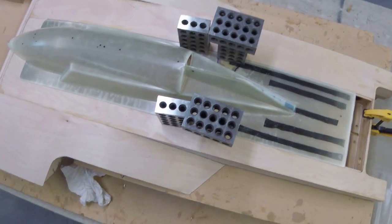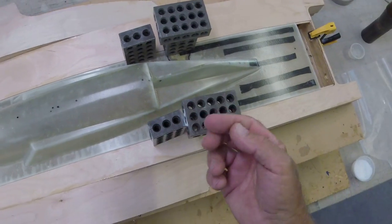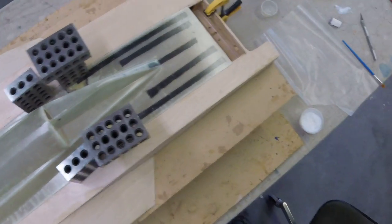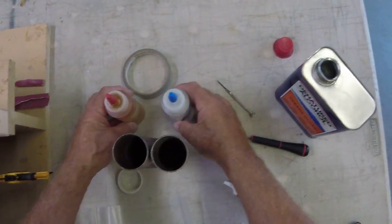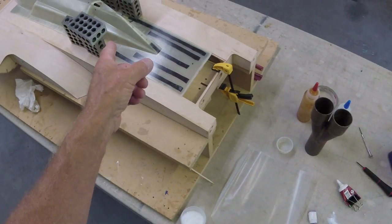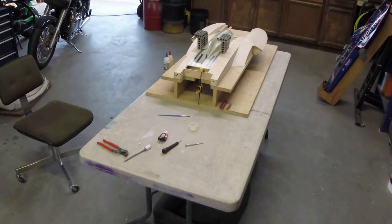Only time will tell. Worst case scenario, you can set a good soldering iron on the end of that little bolt. Heat it up really good, and then it'll spin right out because it'll loosen that epoxy up really nice for you. Turn these over so it doesn't run out and go everywhere. Get a little alcohol in a rag. Clean your hands up. Ooh, can't wait to pop it. That is tomorrow. All right, let's go ahead and do this thing.